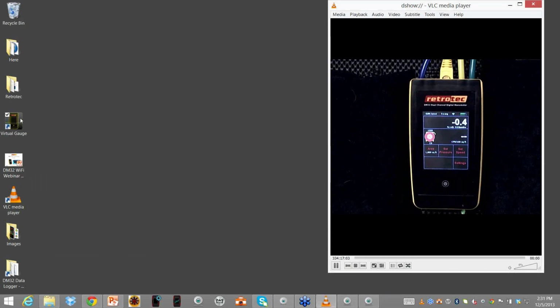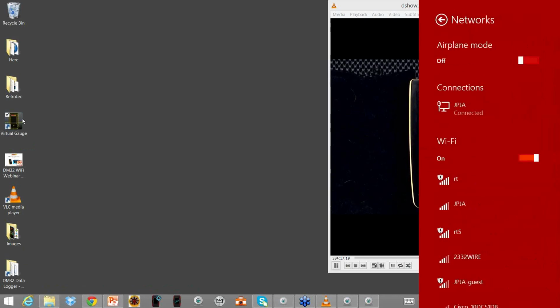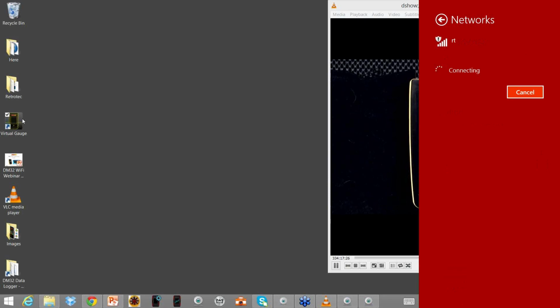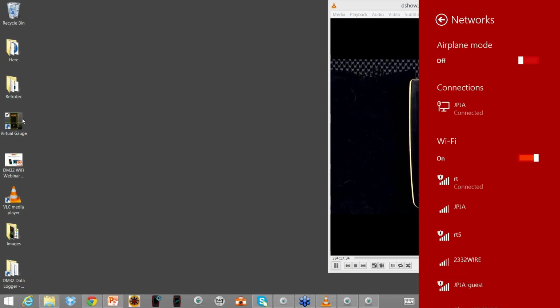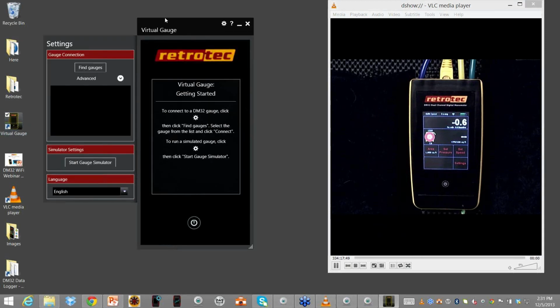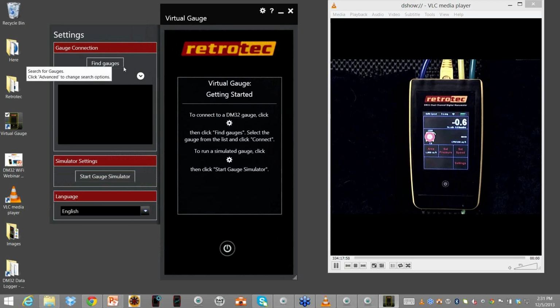One second. There's always a live error that must happen whenever you do a webinar. Oh, I know. One second. Settings. So this is one of those great learning features that happens live: when you are using any device, you need to confirm that the secondary device is on the same network. So I have my gauge set up to connect to the router that I have. Whether it's your phone or your smart device, you need to make sure that it's always on the same Wi-Fi connection. What commonly happens is that your device wants to find the best, strongest signal for Wi-Fi wherever it goes, and so if you shut things down, it will want to find maybe one that you didn't really want it to find.